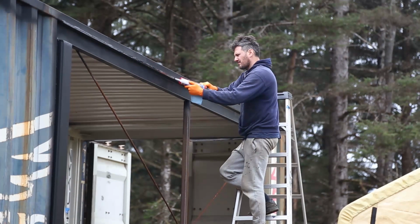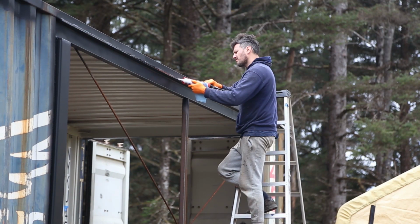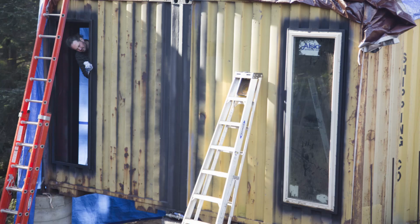The sealant we used is a marine grade sealant, so it actually requires moisture to set, and I highly recommend it for any wet climate. I'll put a link in the description for the exact product we used. For the picture windows, we didn't install them any differently than a typical build. We screwed them into the frame from the outside and sealed around the flange.